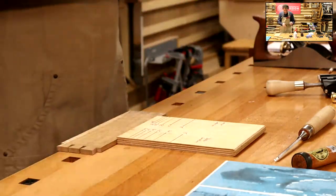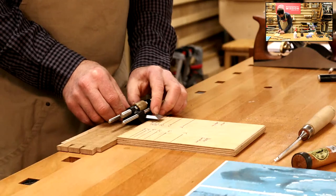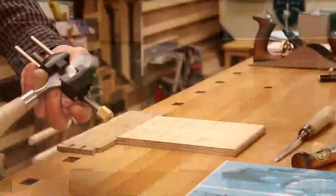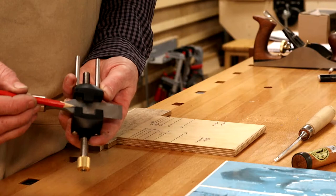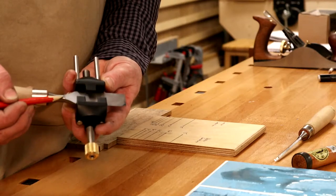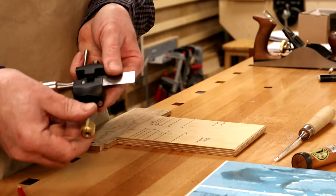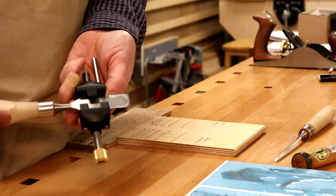Get our position. I'd want 30 degrees. Now I can just get up to there. And again, this is one of these things that I kind of ooh and err about, but this is good for you to know. Now with the beveled edge chisel, this is the back here. You can see the tooth that grips it right up to this corner. But look at the shape of the chisel where it starts to curve away. Once I start to lose a bit of material and I've got to move the chisel forward, how's it going to grip it? I've got probably a good 3/8 of material before we get to that point. So you're going to wear a lot away before you get to there.